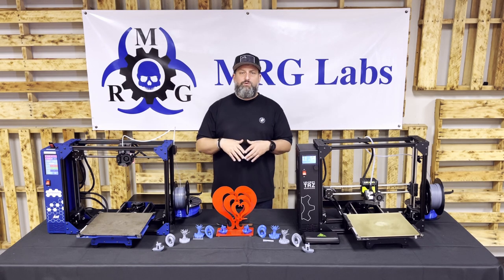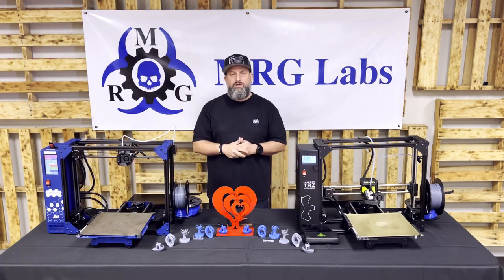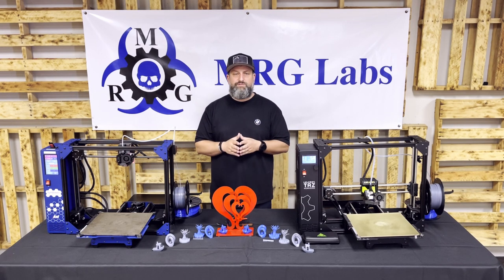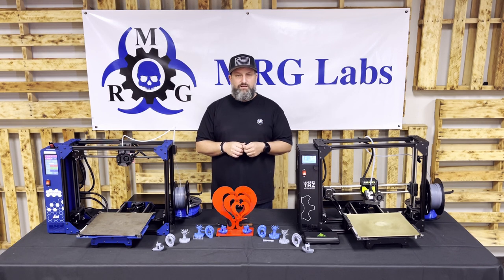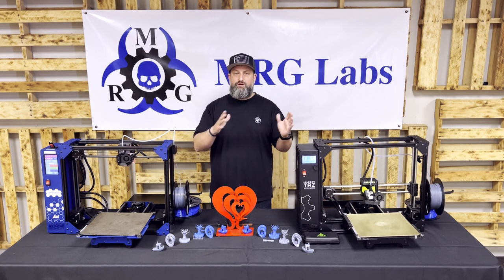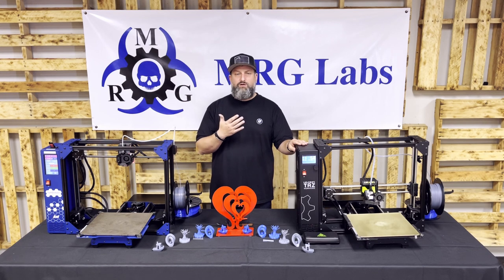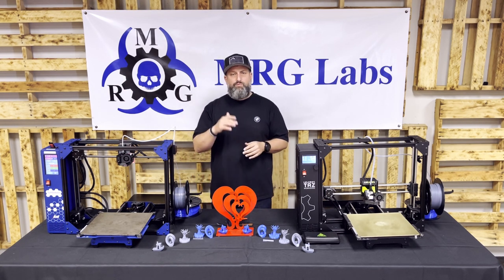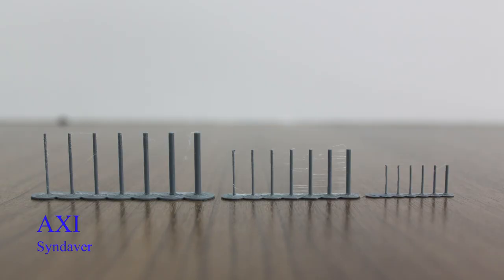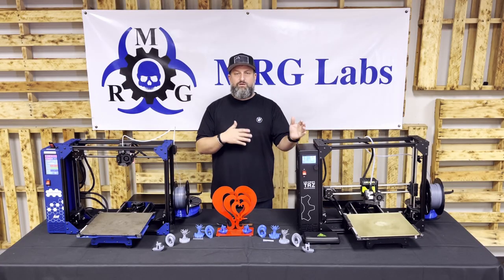Next, onto Pillars. The Pillars model was sliced in the standard profile for each printer and I used PLA filament. I ran these in three different sizes to examine the feature size range and capabilities — each size has a specific diameter variance giving an exact idea of how fine the feature capabilities can be printed. At 200% scale, both printers were able to complete all of the pillars with comparable finish quality. At 150% scale, the Axie was able to complete all pillars with little change in quality from the large. The Workhorse, however, had a slightly harder time — it did start all of these pillars but was unable to complete them without significant issues visible in the Z-axis. At 100% scale with pillar diameters of 0.4, 0.5, 0.6, 0.7, 0.8, 0.9, and 1mm, the Axie completed all but the smallest diameter pillar (smaller than the nozzle diameter) with similar quality as the larger two. The Workhorse missed the two smallest diameter pillars and had similar Z-axis issues as with the medium size.